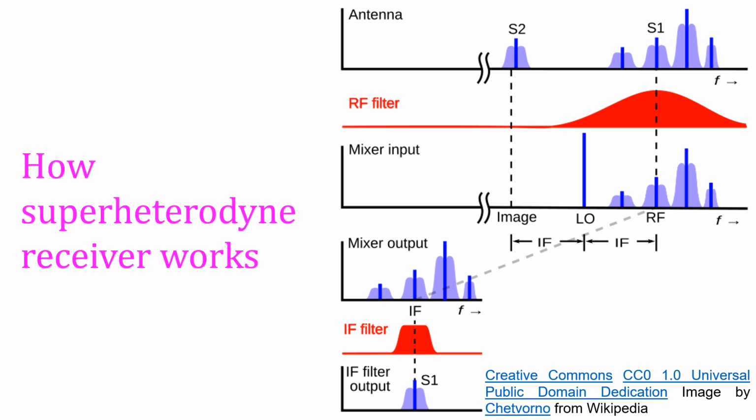When a station on the image frequency is present, both stations will interfere with each other in the IF stage. This can be prevented by filtering the image frequency in the stages prior to the local oscillator so that it does not produce the same output intermediate frequency in the IF stage. Suppose the IF is 455 kHz, the desired signal is 1000 kHz and the local oscillator is tuned to 1455 kHz. The mixer output will be at 455 kHz.